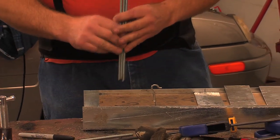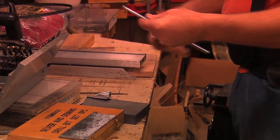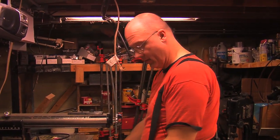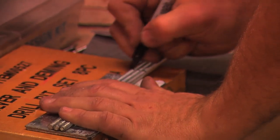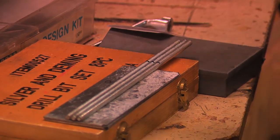Now it's time to make a mess. The first thing I've got to do is mark the rods and cut them to length. It turns out the rods need to be about a quarter of an inch longer than the plates, so I have a handy measuring device with me. I've also looked at the edge of the rods to find factory ends so they aren't stripped out, and I'll try to leave those on. This doesn't have to be precise because there's going to be a nut going down on the rod to hold it in. I'm going to come over to the saw and cut the three rods to length.